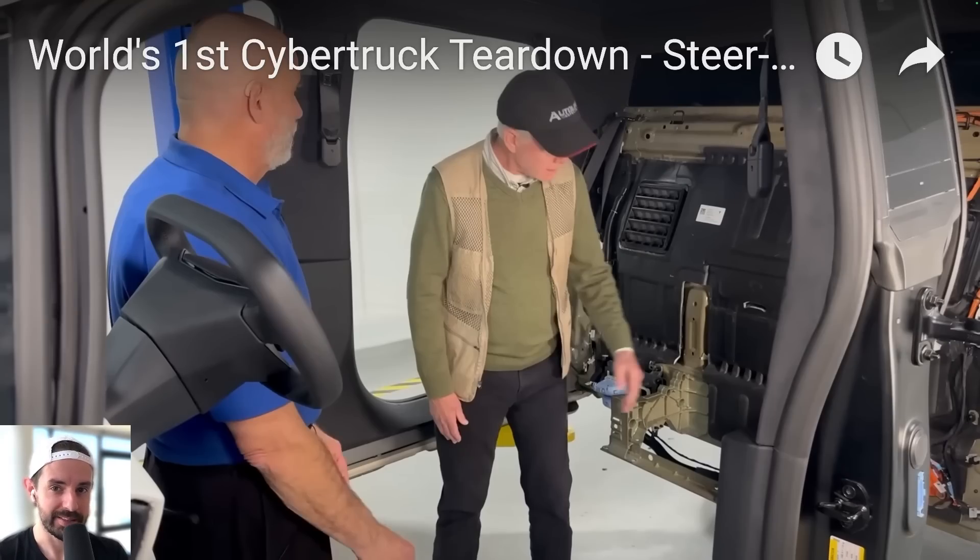These insights are already becoming quite a big deal. Tesla first started with a decently sized casting for a portion of the rear, then the entire rear. Now we're seeing the Cybertruck with a gigantic casting in the back extending into the rear seats, and even the front seats sit upon a casting. The reason this matters so much is because each casting deletes dozens — if not hundreds — of parts that need to be assembled, fastened together, handled, stored. This saves costs, time, complexity, and potential points of failure. As Musk said years ago, he really did mean it: the best part is no part, and the best process is no process. We're seeing this manifest in Tesla's latest vehicles.